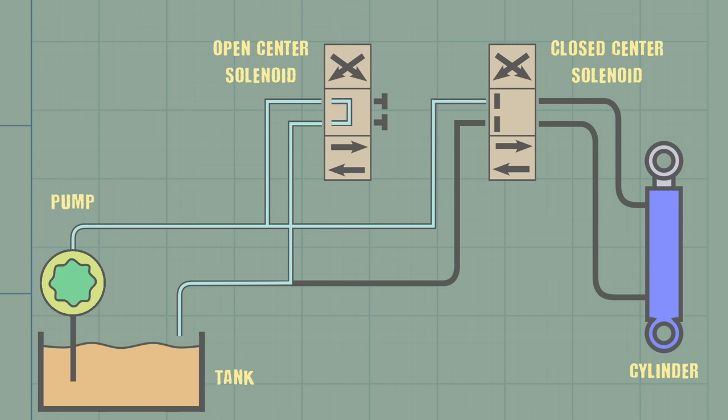Somehow, I made the program more complicated, but I think it's a lot better. I made it modular. If you want to sound cool, you call it object-oriented programming. And it's kind of a hatchet job in C++. But the advantage is, since we have four solenoids that are basically the same, if they all share the same modules, when I fix a problem with one solenoid, it should automatically fix that same problem on all the solenoids. At least that's the theory. Now it's working too good. The lights are on, but nobody's home. Let me show you 30 hours of software integration.